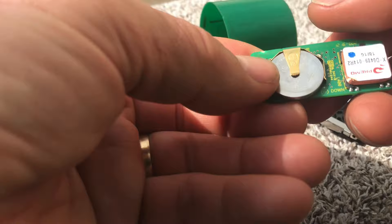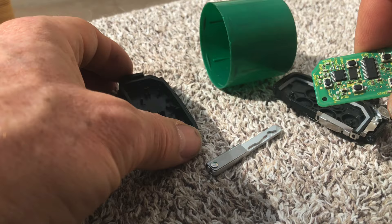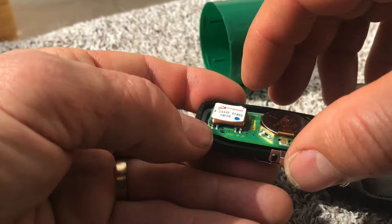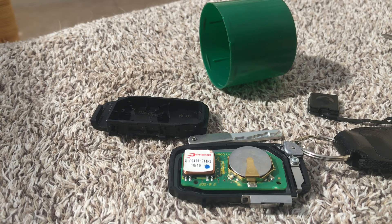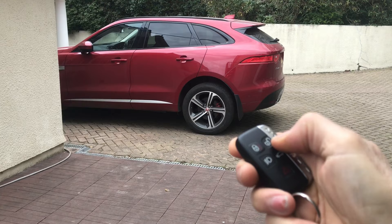So that's it — I hope that helps. It's not guaranteed to work every time, probably about 50-50, but this has worked a couple of times for me, hopefully it'll work for you. For reassembly, it's just a straight reversal of dismantling. I'd recommend straightening off any burrs and pulling off any bits of plastic on the studs first, then push the cover back on, melt the plastic studs down afterwards, and push the case back together — it just clips back, nothing needs screwing or gluing. That's probably saved quite a few hundred pounds on a new key fob and programming by the main dealer. Try not to put your key fob through the washing machine! Thanks for watching.